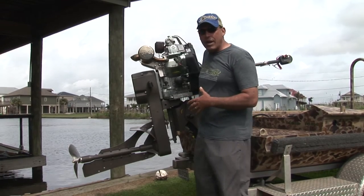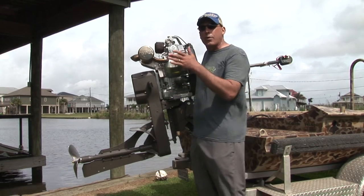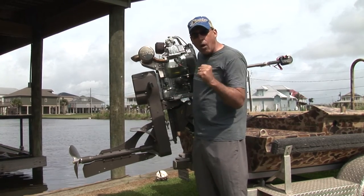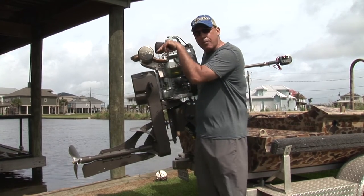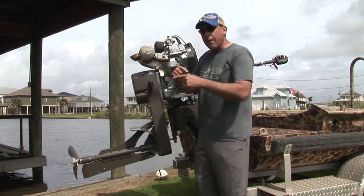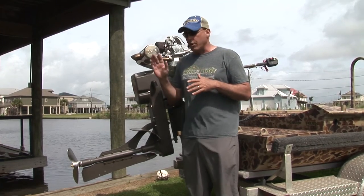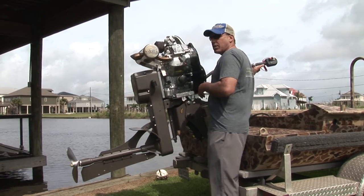The reason for the trim is so you can adjust the mode, just like an outboard motor — trim it down to take off and trim it up to get top speed. Very similar with this as well. If you're not familiar with a mud motor, where you get your power — your four-wheel drive — is when you trim that prop low. When that prop gets buried underneath the mud and water so that every time the propeller turns, it catches 100% mud or 100% water. You want to trim that motor all the way down so it won't cavitate. Let me show you how low this thing will go.